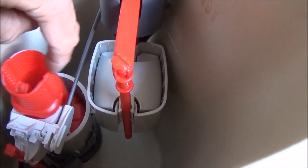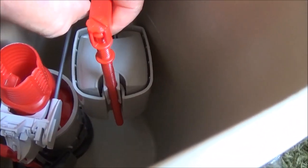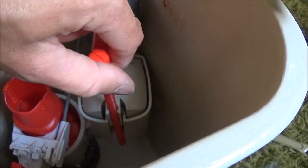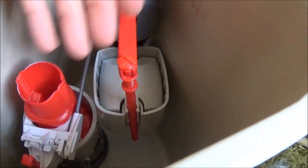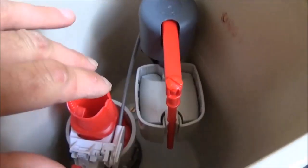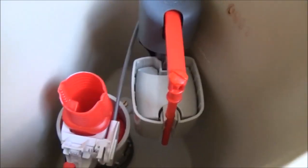I've got it all assembled. There's a little thread there and a place for a screwdriver so you can move this box here up and down. I've moved it down because you've got to have this lower by about 20mm in the top of your overflow chamber. The idea is this comes up and that will lock the water intake off. Now if this is too high, this will be overflowing before the system stops bringing water in. You don't want water constantly overflowing because your system will stay open and keep allowing water in. That's the kind of thing you can have a fiddle around with when it's in situ and just get it right when the water's sorted.